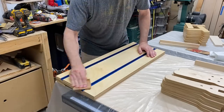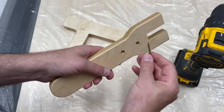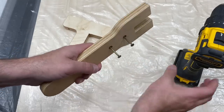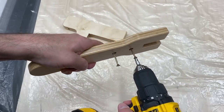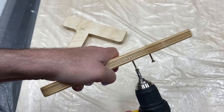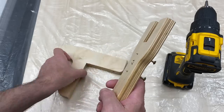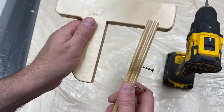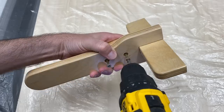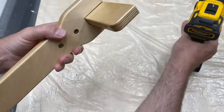After the final finish coat, I used a brown paper bag just to rub down the surface. Now it was time to put all the tool hangers together and really see if this thing would hold tools like I had planned. Before finishing the pieces, I had pre-drilled the holes from the top piece through to the bottom piece and made sure all of these parts were matched up — you can actually see that I numbered them all individually. This really helped all the parts fit together perfectly and accounted for any little changes in the way I drilled through the pieces.